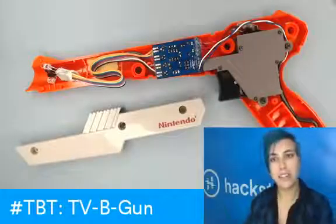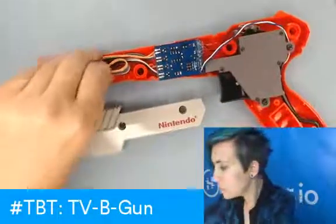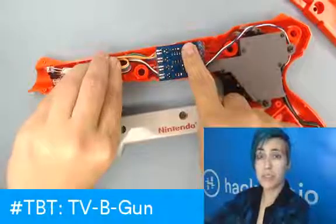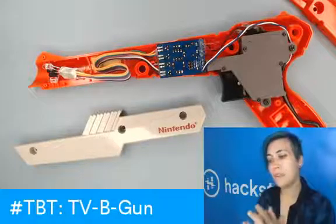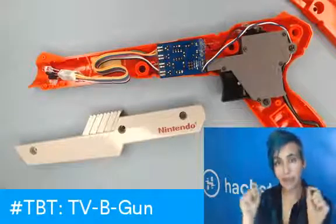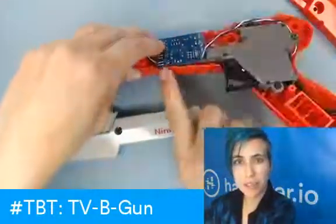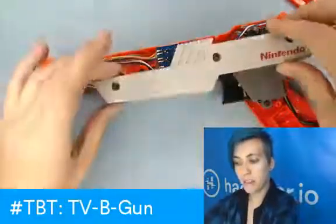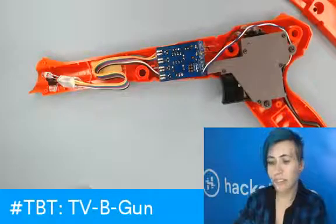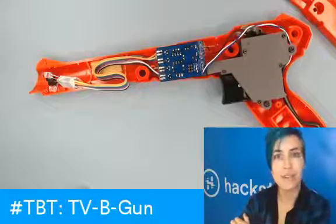So what I've got to do now is basically stick it all back together. I think both of the trigger locking screws are already on here. Getting this all back together is a little bit of a tight squeeze. I actually had to extend the capacitor — I've got pictures of this in the tutorial I'm going to post. I had to take the capacitor, which you're supposed to lean down flat on the board. I forgot to do that, so I've stuck a couple of extension wires onto it and made it lay flat. I still had to make a few cuts into the actual case of the gun. Since it's got a cover on it most of that is going to be covered up, and on the top I'm going to put a label with the name of the TVB gun so that I'll be able to tell people what it is and it'll cover up any extra cosmetic issues caused by fitting the circuit board in there.